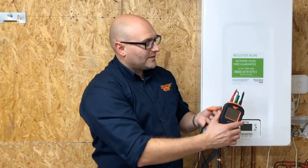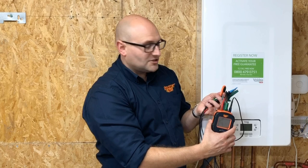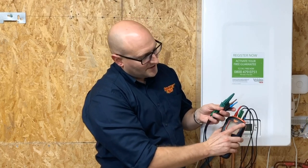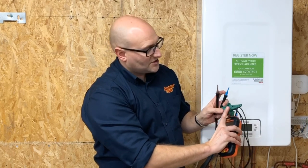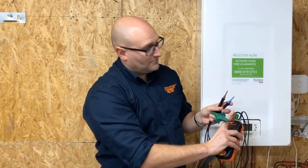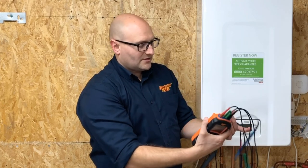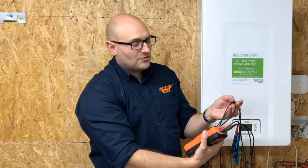The DLM Pro comes with a magnetic fob so you can attach it to the boiler chassis. It also comes with compliant test leads — all the metal on the clips is insulated so you're not going to hurt yourself, and the exposed tips on the prods are all compliant. The cables are hard-wearing silicone and they're also wear-indicating, so if you see any white coming through on the black, you know it's time to replace the cables.